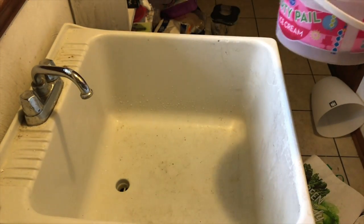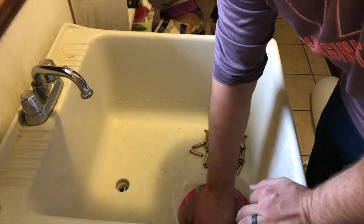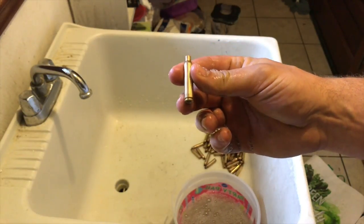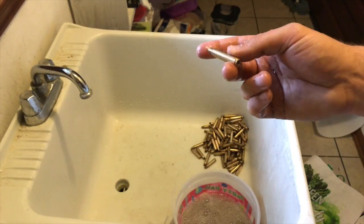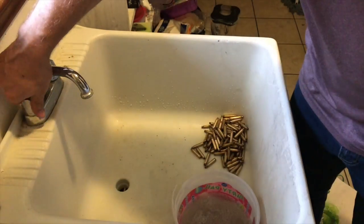Let's take it to the sink. I'm not going to dump all the fluid out because I've got some other brass that I want to clean later — this is still good for a few more uses. So I'm just going to scoop the brass out, set it in the sink, and then we're going to thoroughly rinse each one. Even without polishing it with my rag, it's already looking quite a bit shiny. I wish I had taken a before picture, but it was just dirty range brass, and if you're a reloader you know what dirty range brass looks like. Now let's wash these through — this is also a good opportunity for inspection of the shell and to take your pocket cleaner and clean out the primer pocket.